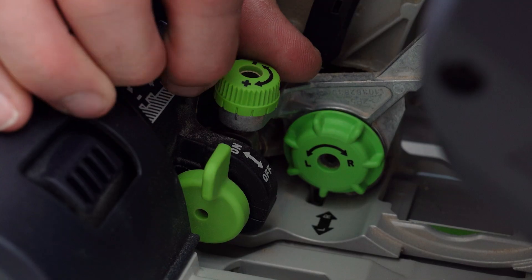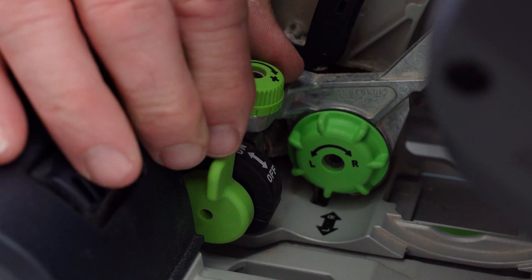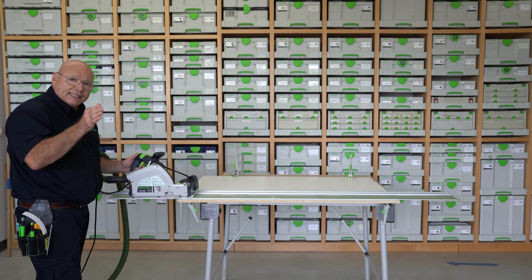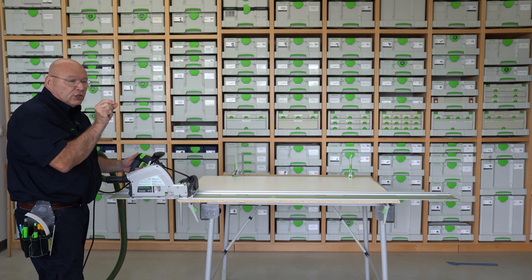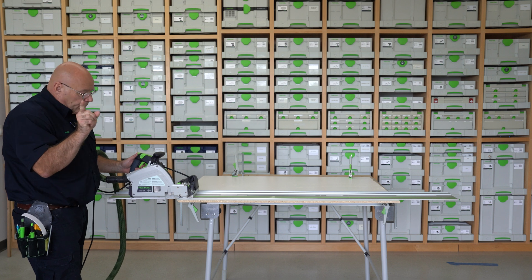It's just one, two, three — and that is each tenth of a millimeter. So let's make a cut and we'll stop it about halfway so we can examine if the blade is cutting at the right depth, the scoring blade, but also that it's adjusted to the same width of the main blade.